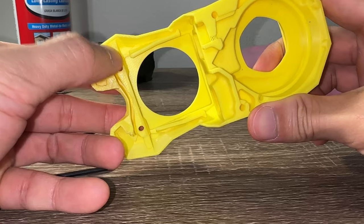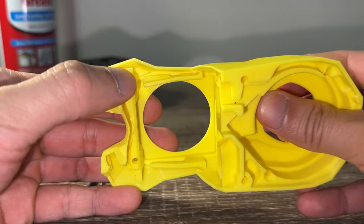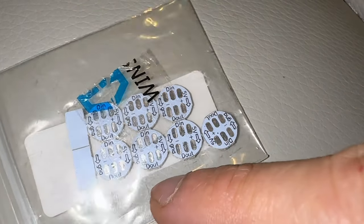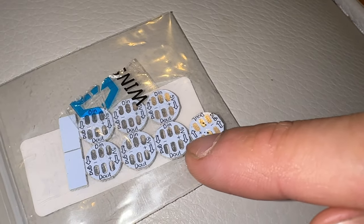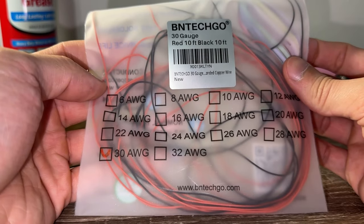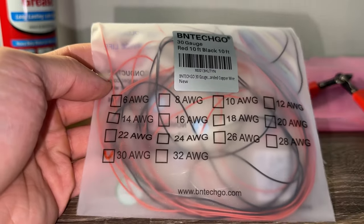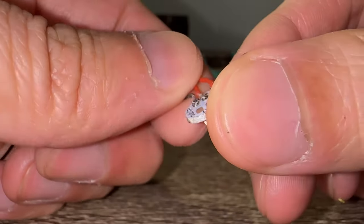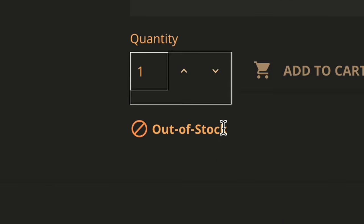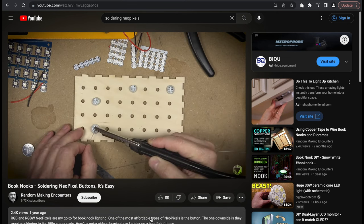It's hard to see and trim these supports, so take your time and use good flush cutters. For the NeoPixels, I am referencing the wiring diagram — it's hard to see where all the wires go, so take some time to look over it. Each NeoPixel has a data in and data out, along with 5V and ground connections. Most wire pairs only come with 2 colors, so you need to find a way to label the third wire. If you have not done this before, it sucks — I was about to give up and just buy a wiring harness, since $10 is well worth the avoided hassle.